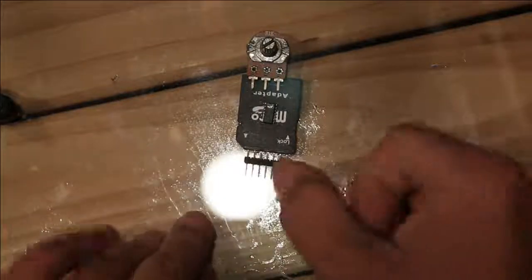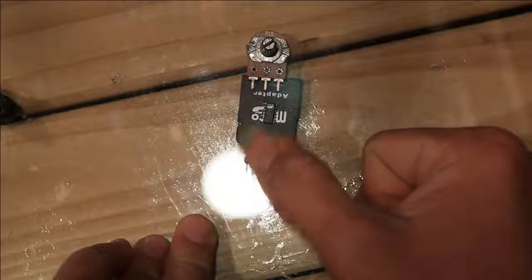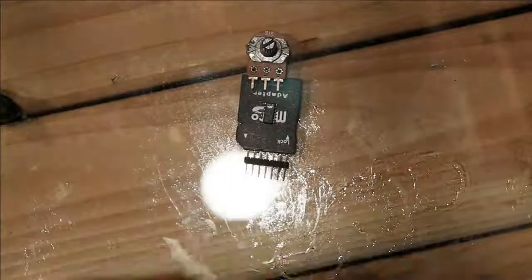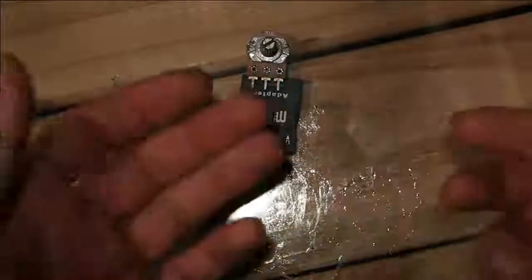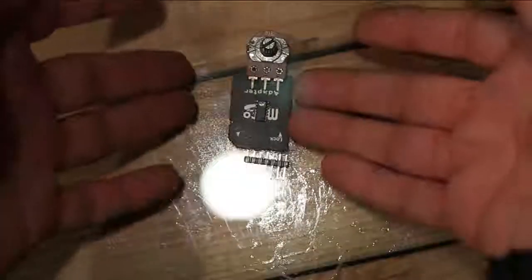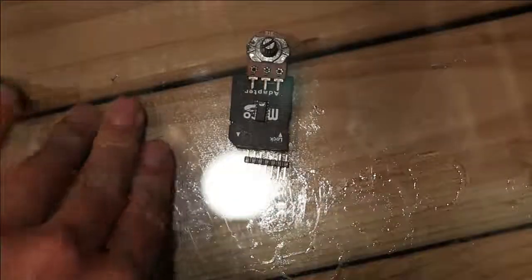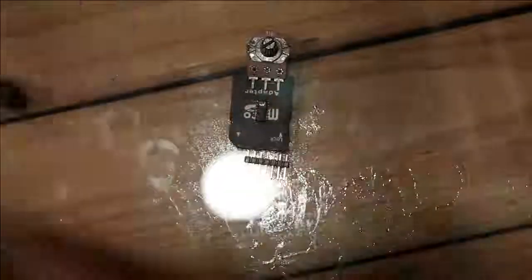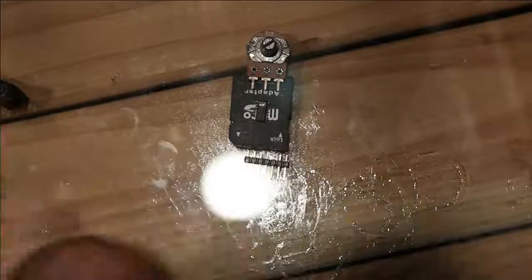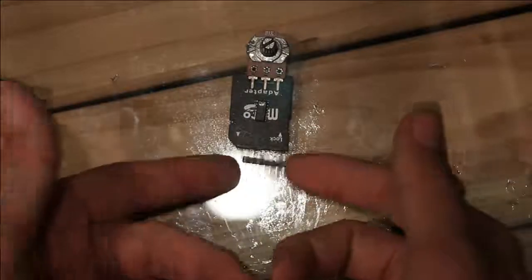And then also you would have it switching the negative of the, actually, why would you want to put the common of the supply there if you're not? Because I would put the 10 meg ohm resistor on the main board itself. It'd be a lot simpler. That just prevents popping in the bypass circuit. It goes from that to ground.